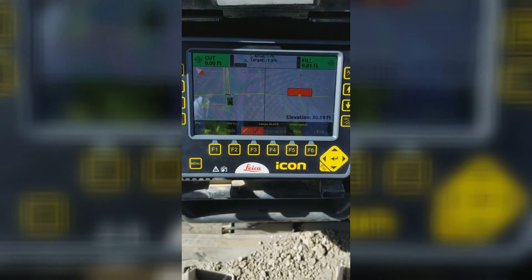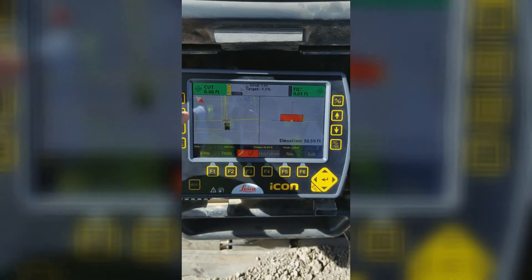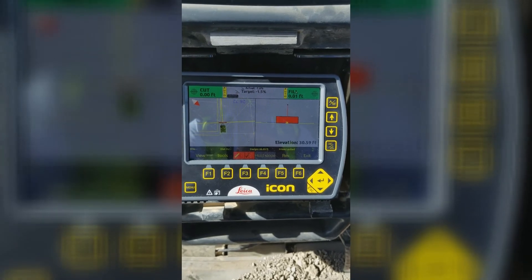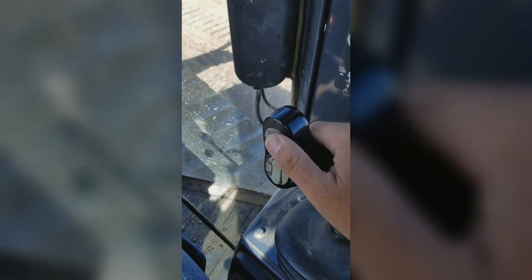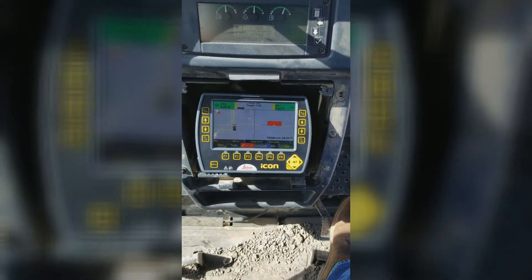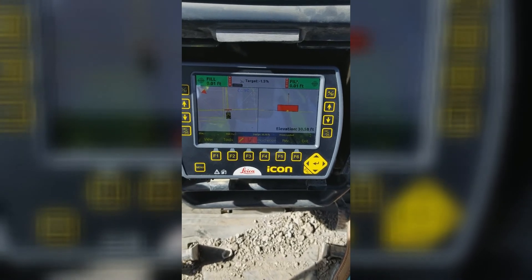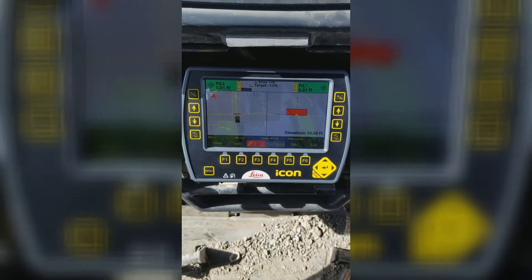We've benched in and I'm ready to get to work. The first thing I need to do is arm my left and right side to where it's yellow — this is like a safety on a gun. Now we can use our IGC controls. This is a John Deere 650K, an awesome machine for machine control. This is your offset up, offset down, and the auto button is right in front of it. When you engage auto it goes red. Hit your same button on your IGC joystick and it disengages auto.